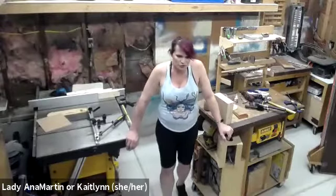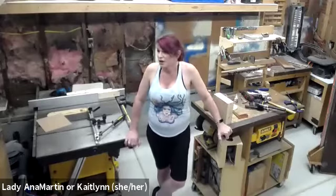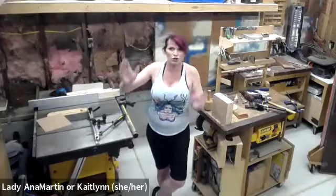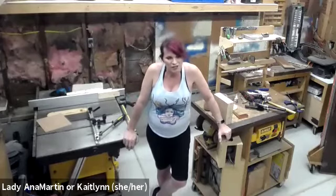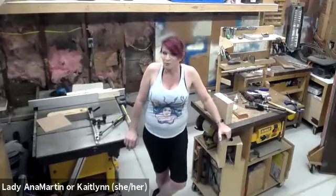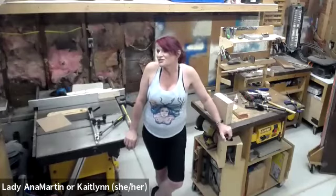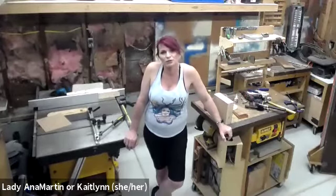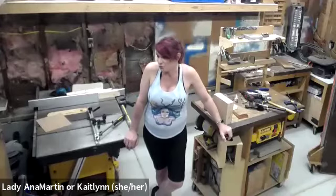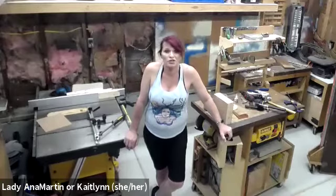There's a furniture maker called Frank Klaus, who is an incredible master, particularly of dovetail joints. His dovetail joints, you can pick them out anywhere. They're hugely wide. They're this giant angle. And what he says, and I agree with him, because I'm definitely one to criticize master woodworkers, is that the most important skill in hand cut woodworking, or even I guess machine woodworking too, is the ability to cut to a line, particularly to split a line.